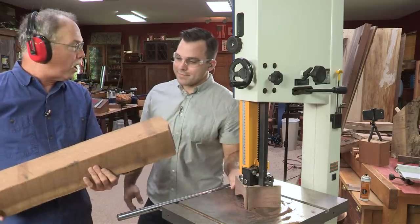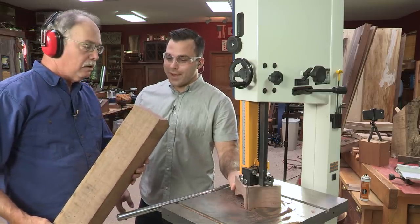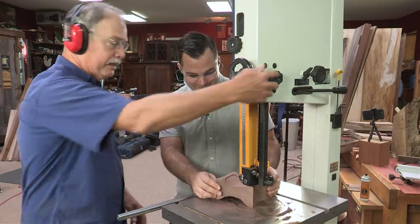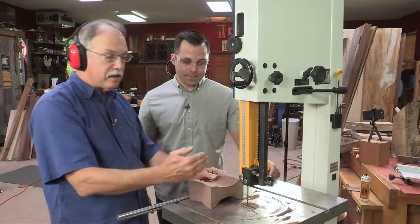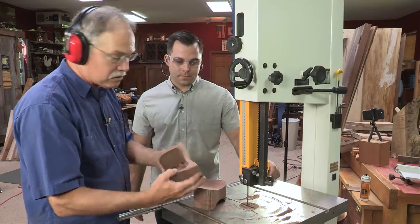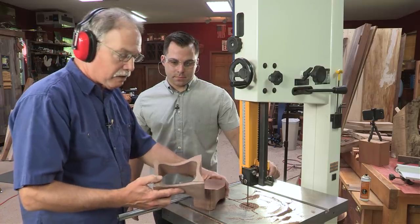Now that's coming to a break. It started out of an old barn beam that was going on the burn pile — if you went to a woodworking store for a chunk of walnut like this, it'd be scary expensive. Never back out of a cut with the blade running — that could pull it forward, hit the metal guard. Anytime metal blades hit metal parts, you'll end up with a damaged blade and it will not track right.